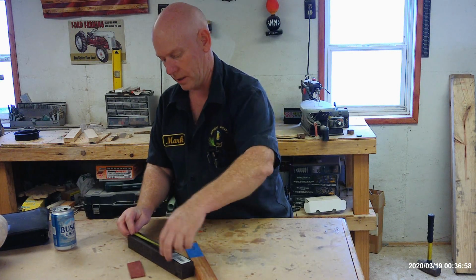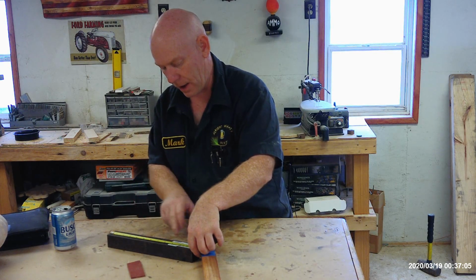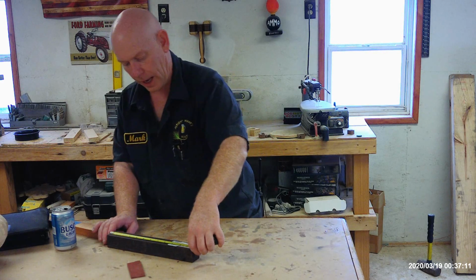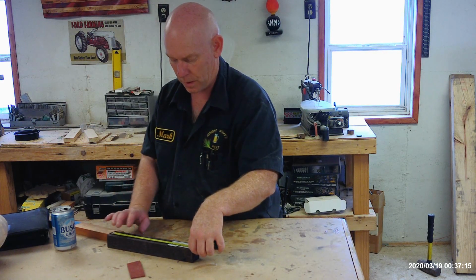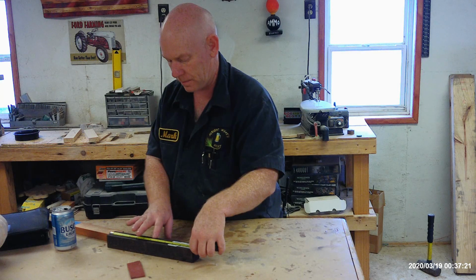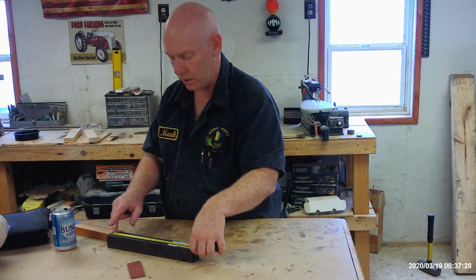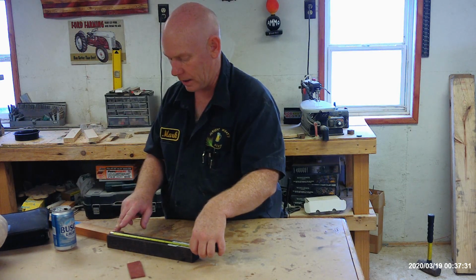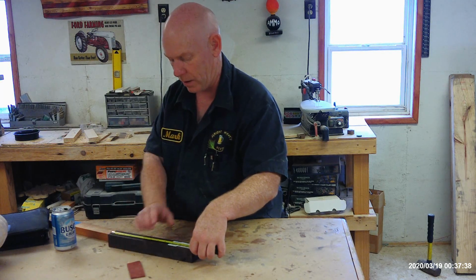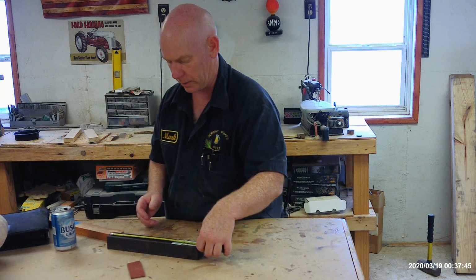So, I think we're going to cut this at, this is a 12-inch blank. If we cut this off at 5 inches, and we make this 3 inches, that'll give us, what, an 8-inch? So let's go with 5.5 inches. Cut this at 3. That'll be a total of 8.5 inches. Nope. Okay. We're going to cut this at 6, this at 3, so that we'll make a 2-inch tang. That'll give us a 7-inch handle. That'll be the perfect size of a handle. Right here, 7 inches. So my leathers will fit on there nicely. Granted, it's going to be turned down considerably smaller.